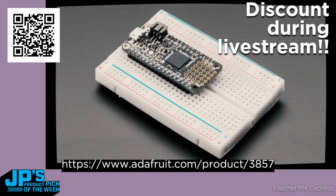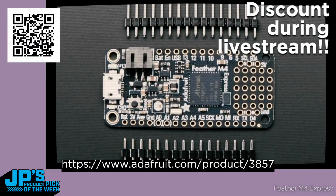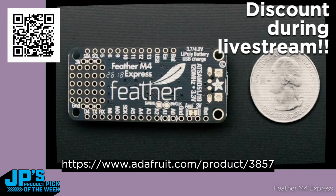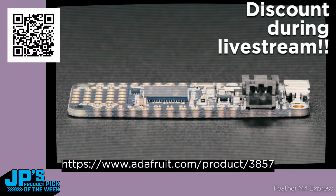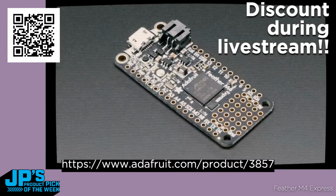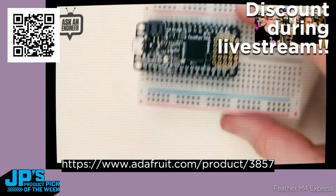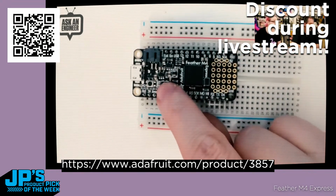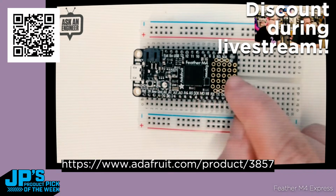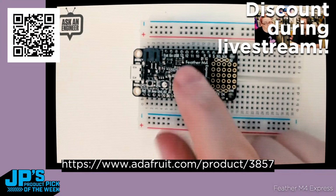The Feather M4. Wow, you've been waiting for this. Feather M4 featuring the SAMD51 processor, running at 120 megahertz. 512K of flash, 192K of RAM. M4 has floating point support, has memory caching support, which is really great. I've been turning that on and using it in the Feather form factor you know and love. Yep. Got NeoPixel, got 2 megabytes of flash, got some proto area. We're using the SAMD51 J19.